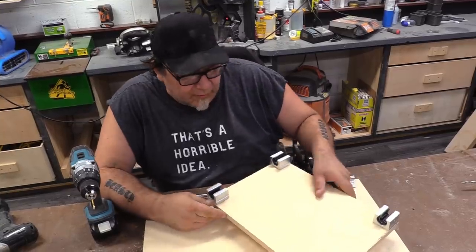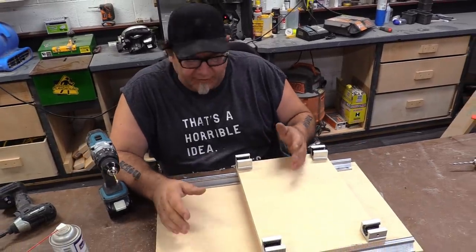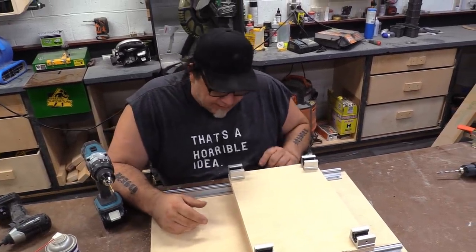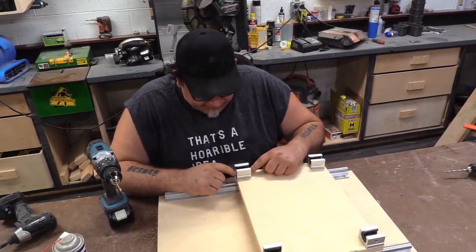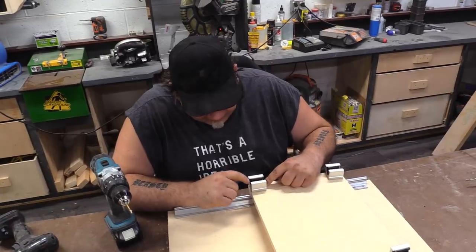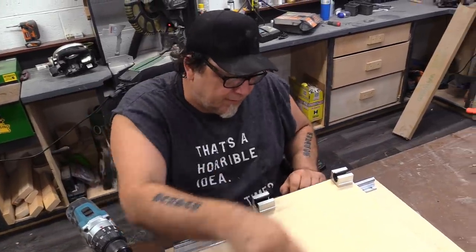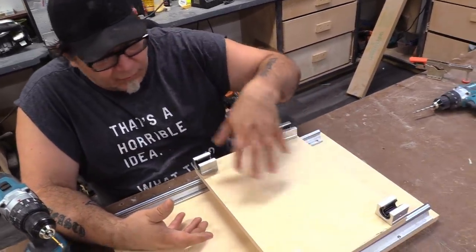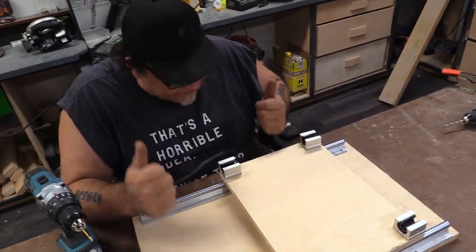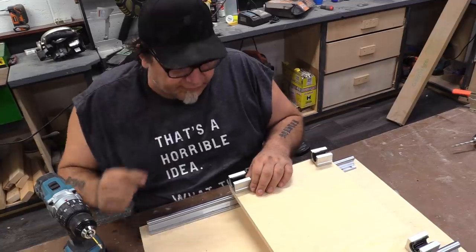So what I'm doing, because we're never gonna park a jumbo jet on this, I'm never gonna throw a 3/4 horse router on here, I'm just gonna drill in from the aluminum housing here and here and put in some 3/4 inch number eights or number sixes, like so. That'll be more than enough because we'll have 8 of those in that position. When we put the other rails on, that'll rigid this whole thing up. So that's good enough for what we're doing in this process. So let's drill some holes.